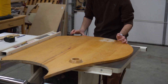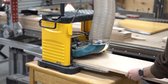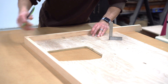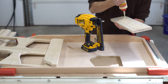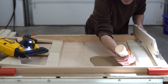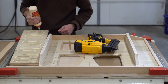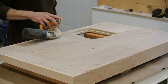To make the edging for the tabletop, I salvaged some maple from an old table that I built. I cut a piece wide enough to yield all of the parts I'll need, and then ran it through the planer to remove the old finish and get it down to the thickness I needed. Back at the table saw, I ripped the pieces to width and then cut the miters. I made sure to take my time when laying out the miters — first I established one corner and then worked my way around the perimeter. I would mark each piece and then take it to the table saw to creep up on that line to achieve a perfect fit. To glue up the tabletop, I clamped the edges in place to act as sort of a jig, and then worked my way from one side to the other. Glue does most of the work here, but I did add a few brad nails to act as clamps. I shot them in at an angle to ensure they didn't poke through the other side, and paid close attention to not put any where I would later route for miter slots. With the plywood glued together, I could then glue the maple trim in place, adding clamps and letting it set up before giving the top a final sanding.